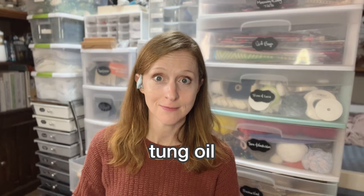The next one, which is far more expensive but a very quality finish, is tung oil. Have you ever used it? This one is plant-based, so it's a natural option. It does dry very slowly, but once it dries it is very strong and durable as far as food-safe oils go. Some people are very allergic, so just be careful of that. Also, it must be 100% pure with no solvents in order for it to be food-safe, so double-check that the tung oil is actually safe to use.